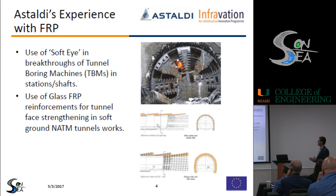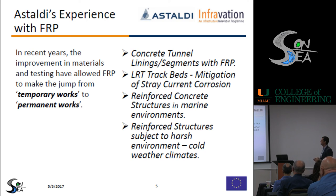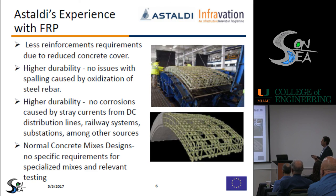Of course, for concrete tunnel lining and segments, for light rail track beds because of the mitigation of stray current corrosion, marine environment structures, and structures subject to highly aggressive environments and cold weather climates. These are some slides that show frequent applications and why: less reinforcement required due to reduced cover and high tensile strength, higher durability, no corrosion caused by stray currents, and a little bit easier concrete design,